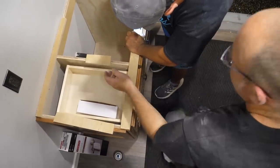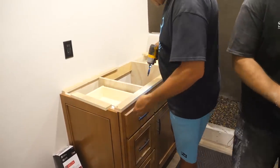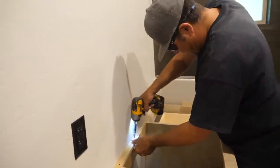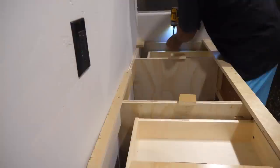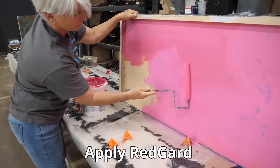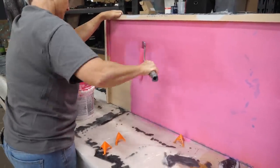I had my good buddy Kenny from RK3 Designs helping me install. We were putting in the screw strips — this was a build-up strip so that the drop edge of the countertop had something to overlap. This was three-quarter inch plywood so that we could either screw from underneath the cabinet to tie into the MDF, or simply use silicone dollops on top of those screw strips.